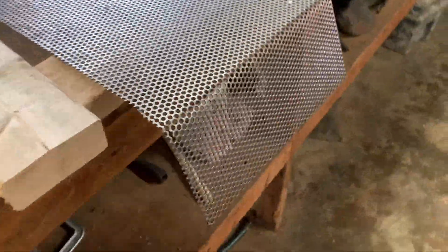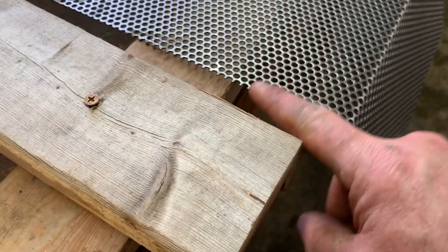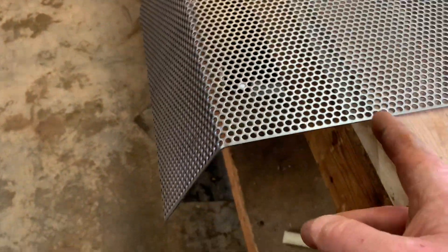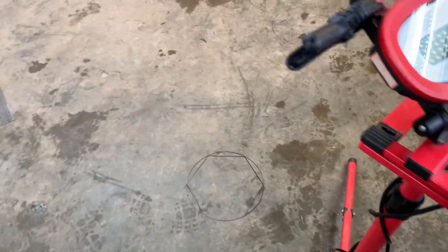I'm going to repeat that process — put this piece of steel back up on the 2x4 with the bend down and measure 5 inches again from here to here. I got a little crooked there — too many PBRs, I think. But that's all right, this is the top and it's all going to be covered. Let me repeat that process a couple more times, get my 5 inches measured, get my board nailed on, and make a nice tight bend.